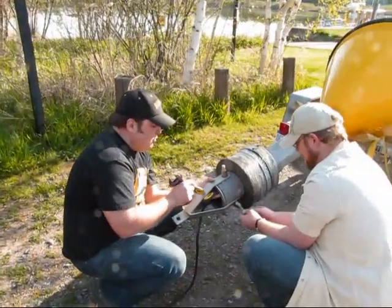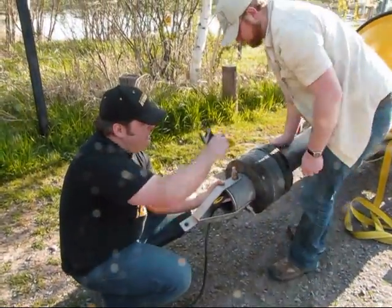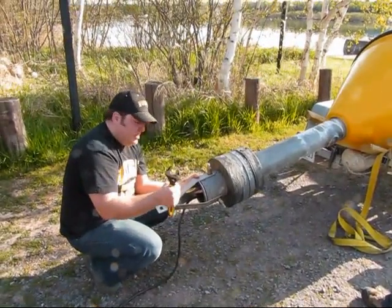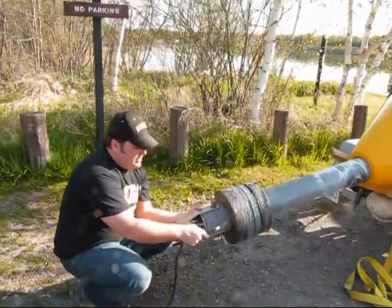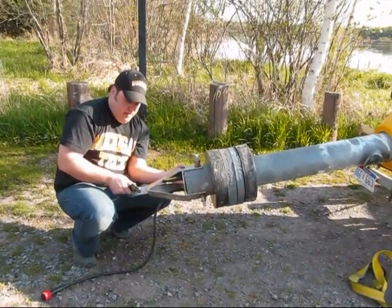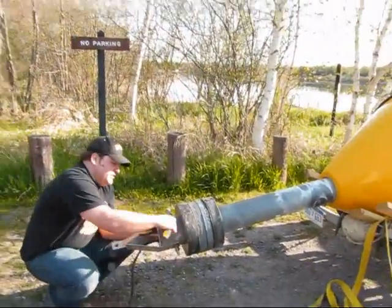We're securing the main mooring point to the bottom of the buoy. This is a composite tube that some of the instrumentation wiring runs down. We've got some lead weights that keep the buoy buoyant in the water in the right direction. We're attaching this mooring plate to the bottom, and then the main mooring point and the thermistor line will connect to this point going down to the mooring. So we're finishing up those connections.